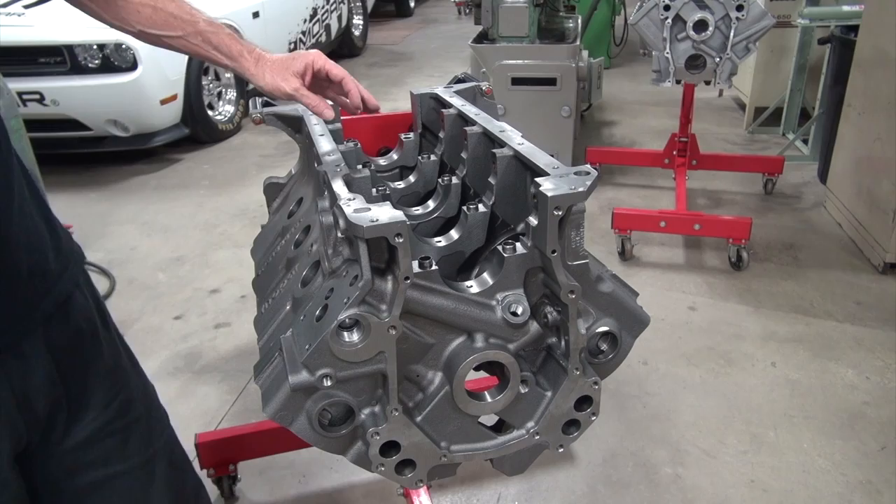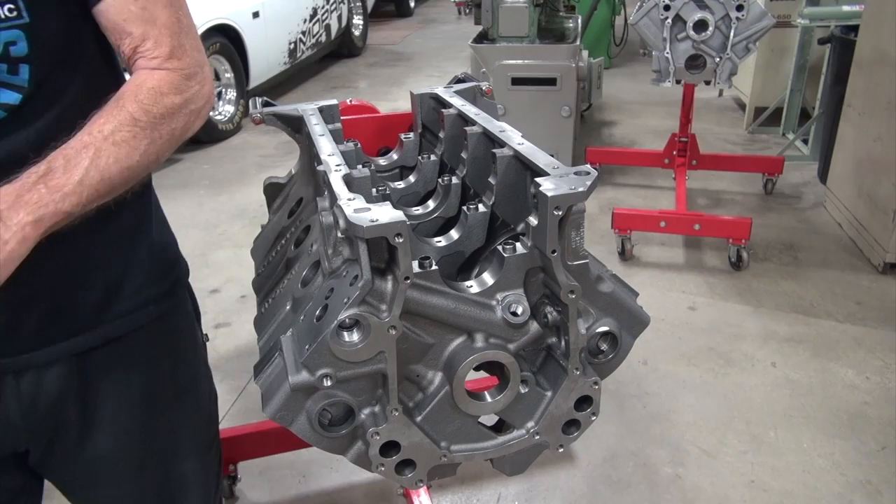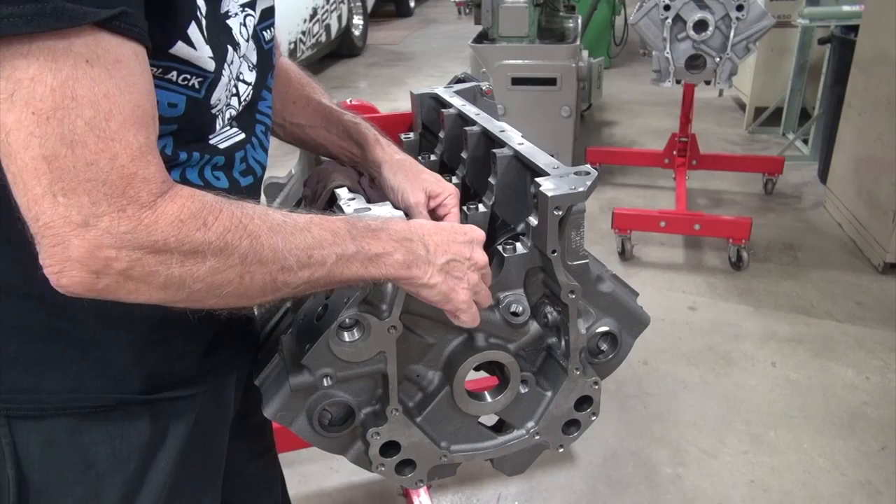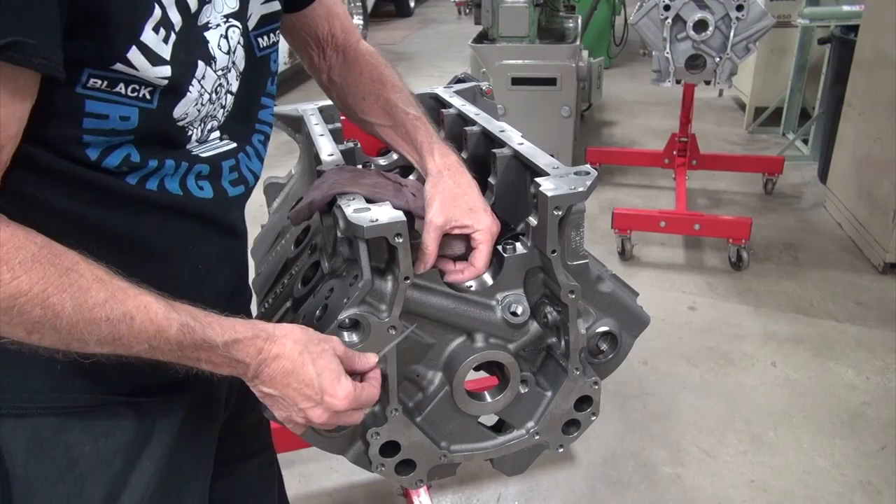Sometimes you get a little funny feeling and you don't know what you're feeling. Take a little 600-grit sandpaper and just work it around there a little bit — kind of radius that edge microscopically. You can't even see it, but it feels better to your finger; you don't feel like there's anything going to get underneath your bearing. Nothing big at all, just something to make it better. After we get everything cleaned up, get some kind of rag in there that doesn't leave a bunch of fuzz. You're not trying to remove any metal; you're just trying to make sure that your cap is seating properly and that everything is very clean.